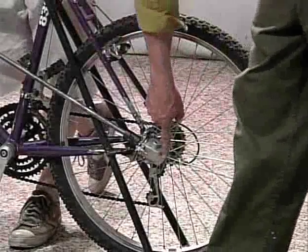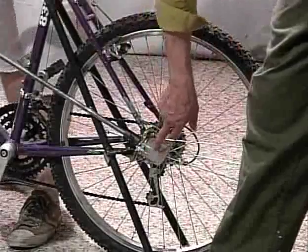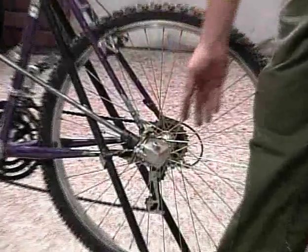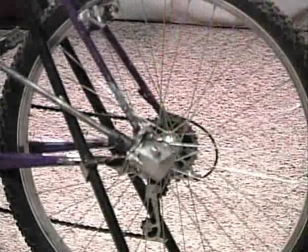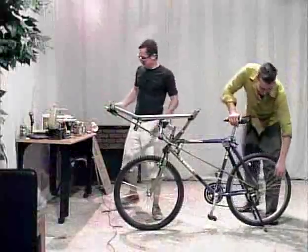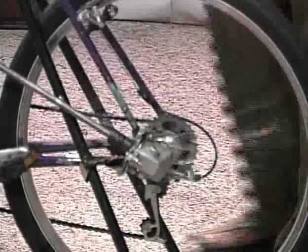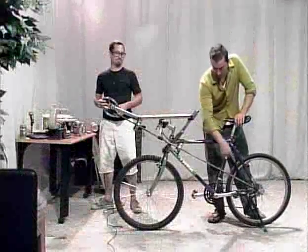We modified the rear hub of a typical mountain bicycle, and we've mounted the head of a right angle grinder, which has a 90-degree transfer ring gear system. That's the head of an angle grinder. And so what that allows us to do is as we pedal this, it transfers this direction of rotation into a transverse direction of rotation, which is now spinning this axle shaft,